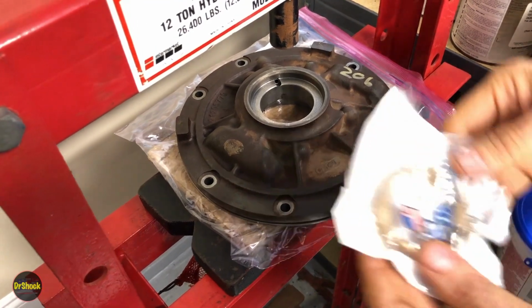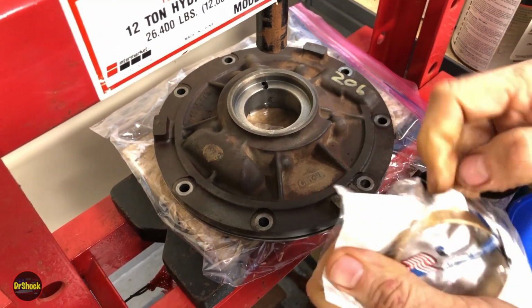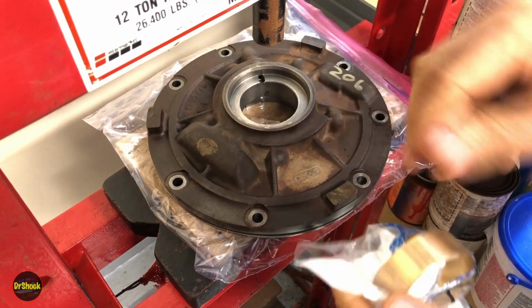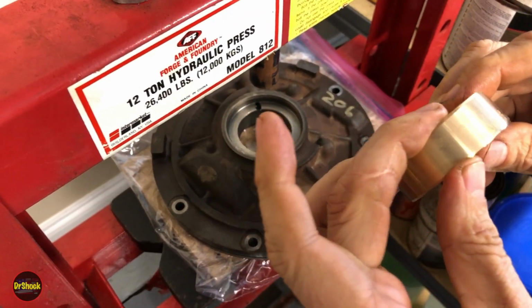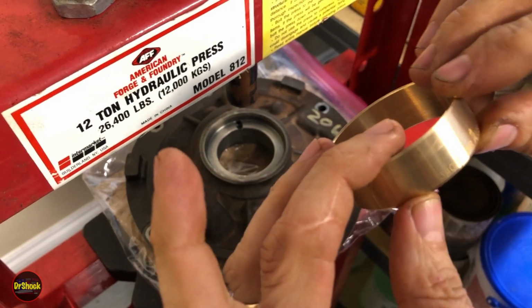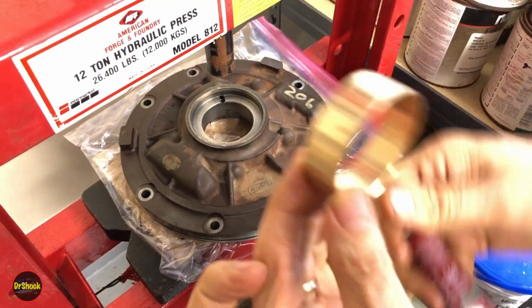All right, let's get our pump body bushing on. This is our 34001 CBR. And again, make sure, just like on all of these, that you've cleaned the inside bore out with brake clean to get rid of any residual contaminants. Here we can see on the outside of the bushing, as always, it's laser etched. 34001 CBR USA. And we're going to use our Loctite 640 to help hold it in.